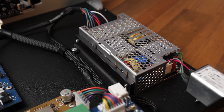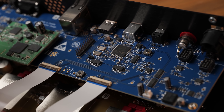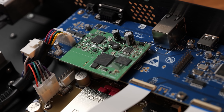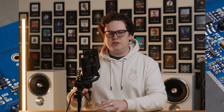On the right-hand side, we see a switch-mode power supply. Given the price of this unit, it would have been nice to see a linear power supply, though this does seem to be a particularly nice one. This big blue board up here is the digital input board, using an XMOS chip for USB and a small daughterboard to provide network streaming functionality. If you look closely, you can also notice that there's a small gap going around the XMOS chip area with some optocoupler ICs, so there is some isolation for the digital inputs built in, which is nice. This will help to reduce any potential noise that otherwise might be passed through if you were connecting the DAC directly to a beefy PC — which is a pretty noisy source — and some DACs are quite susceptible to noise from the source. This one, in theory and in my testing, shouldn't have any issue with that.